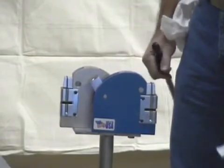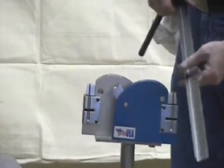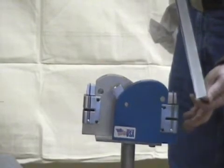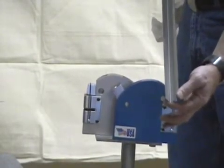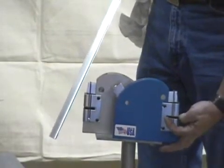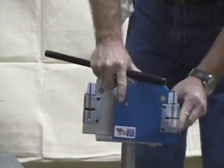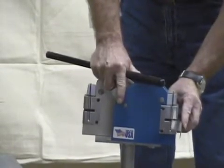Now we're going to do some stretching and shrinking. First you'd put a piece of metal in the sheet metal brake and do a couple of 90-degree bends on it. The width of material going into the jaw can be anywhere from about three-sixteenths to about two inches — it works best somewhere between a half and an inch. A lot of people get confused because the depth of the jaw is only an inch, but you never use the full depth; you only go halfway, which is where the little return spring is. If you put material all the way in, it simply won't work well.